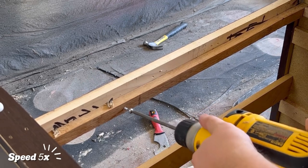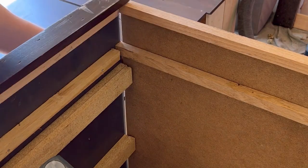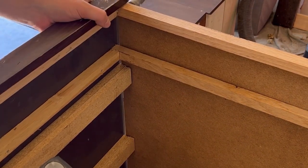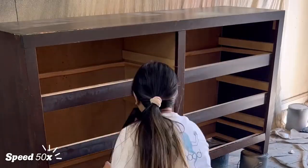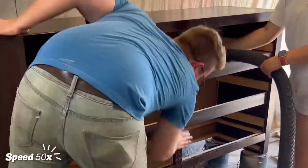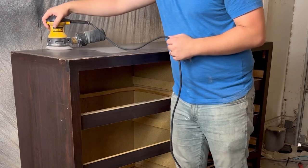On one side while I was removing it, one of those front pieces came loose, so we had to go in with some Kreg screws to sure everything up. The back corner was also separating, so we hammered that back into place. Next up, we move on to vacuuming the inside and cleaning the entire body. After everything's been cleaned up, we move on to scuff sanding — for this, we like to use 220 grit.